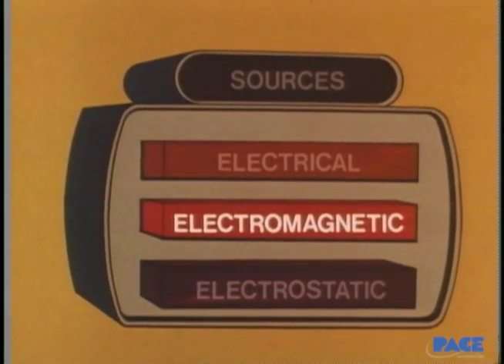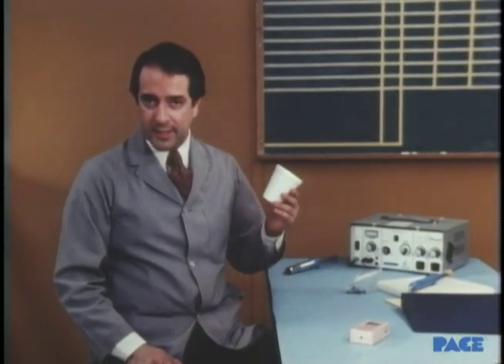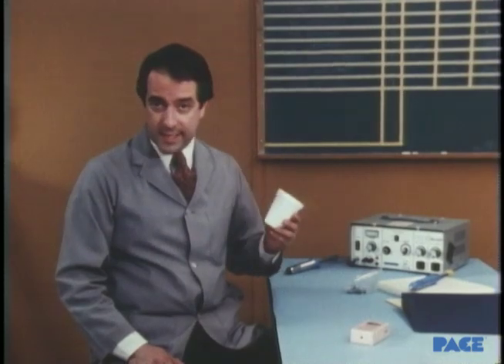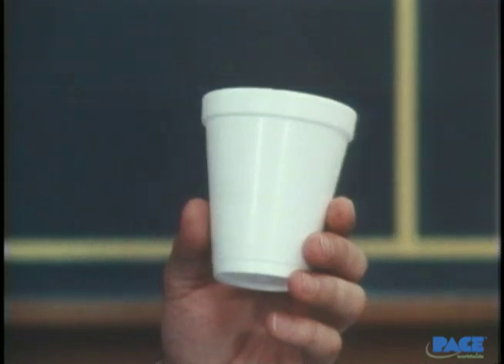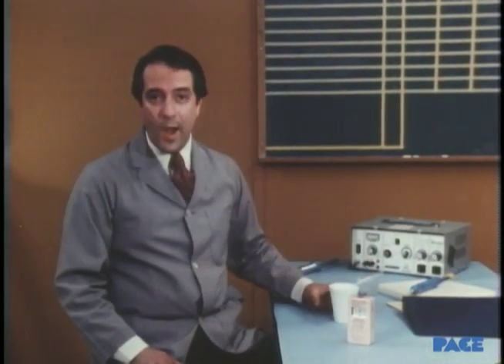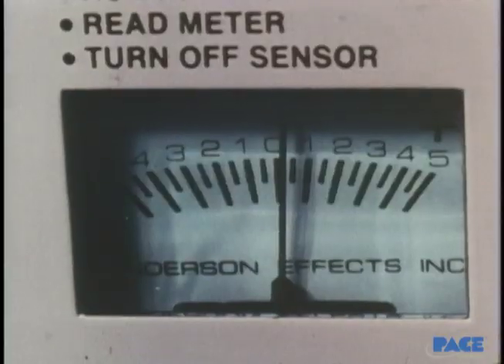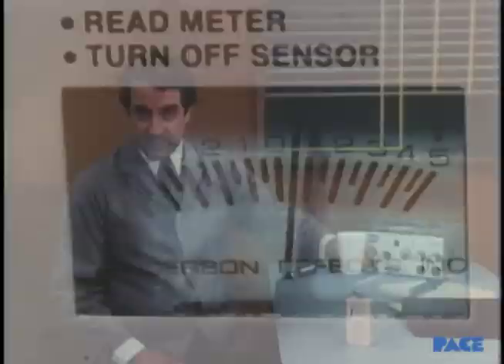The third form of energy that can give us trouble is electrostatic. And the problem is not one of giant sparks. Just by handling this innocent-looking plastic cup, I've now built up a charge on it big enough to ruin a MOS device by even approaching its leads. If we could see these charges, somehow make them visible, they'd be a lot easier to deal with. We can't actually see them, of course, but we can use a static meter to detect them. Watch the needle as I bring the cup down. At this distance from the meter, the needle indicates a charge of 500 volts. Less than 60 volts could ruin a MOS device.